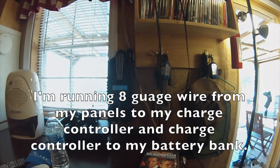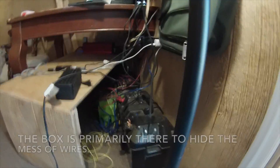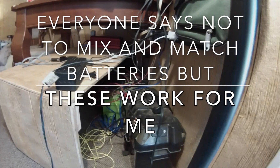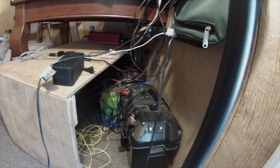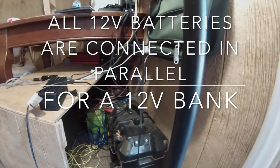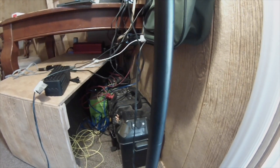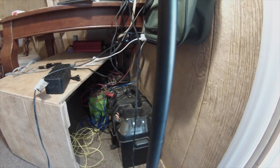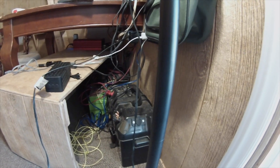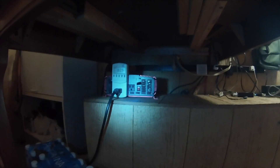Here's my battery box opened up. I have kind of a potpourri of batteries: a marine battery from Walmart, a couple of lithium-ion batteries I got for free that are about $400 each — they're small, lightweight, around 55 amp-hours apiece — and a big VMax battery made specifically for solar power, about $260 each and 120 amp-hours. All told I've got about 450 amp-hours, connected with 8-gauge wire, everything fused. I'll include links in the description. The VMax is awesome.